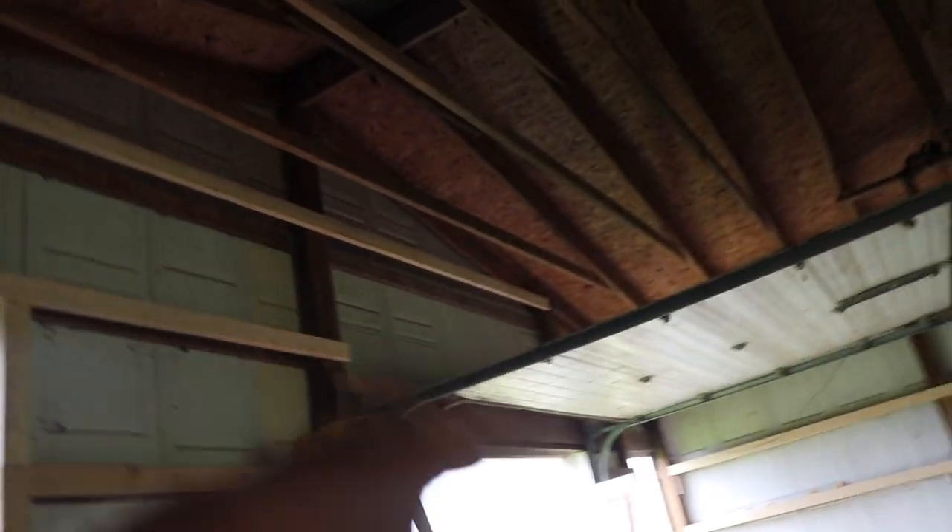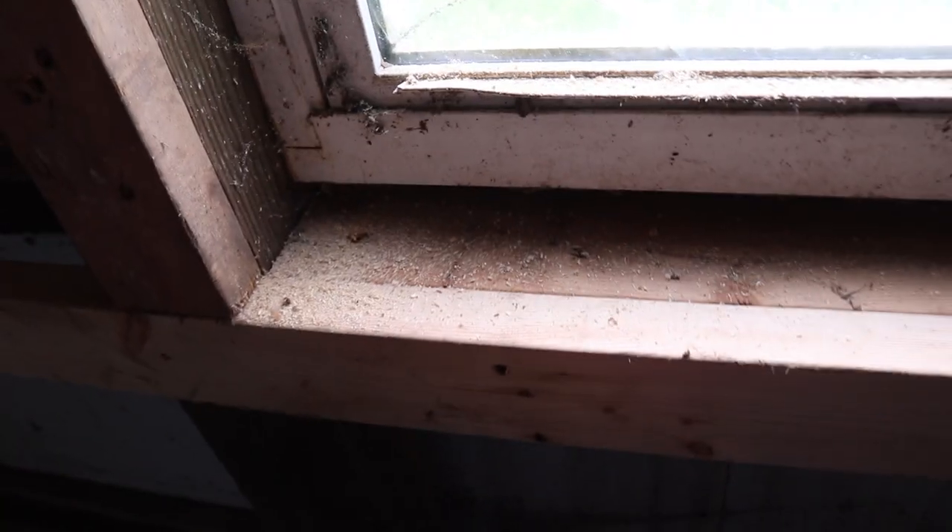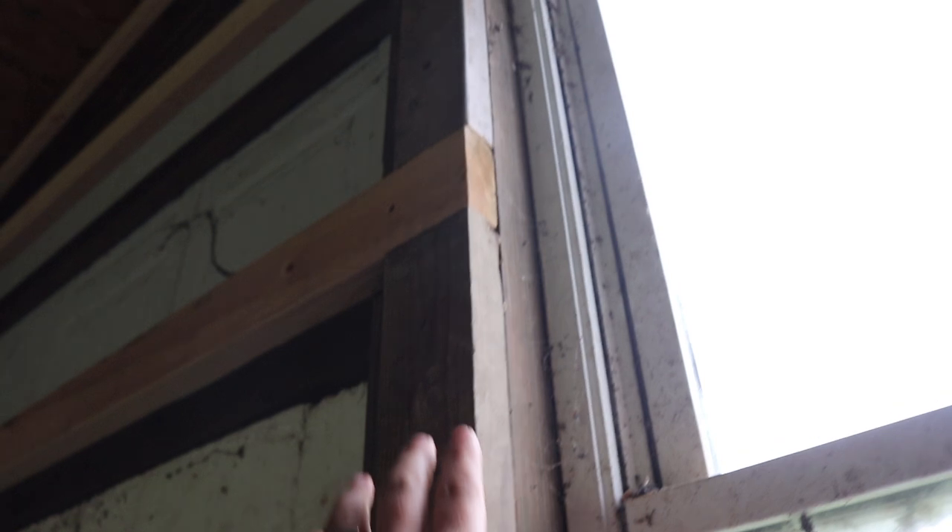We got all that framed out, got the boards ran across the top and tacked to the top of the post so we have something to tack the tin to. This window is all boxed with 2x4 — it's boxed and flush all the way around. I ran the 2x4s to the post flush with the post and put sections in between the 2x4s coming across. That way once we get the tin tacked there are no air gaps looking into the wall. If we blow in insulation into the walls, it won't loosely come out from the sides of the window, but the window can still be accessed if you need to pull it out.